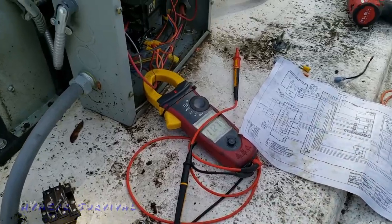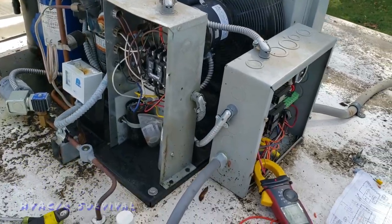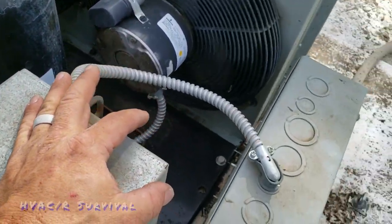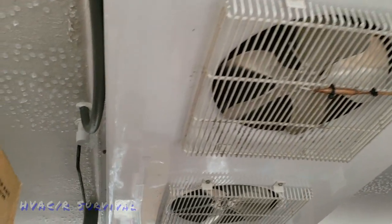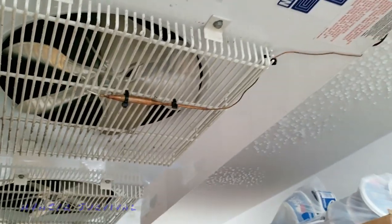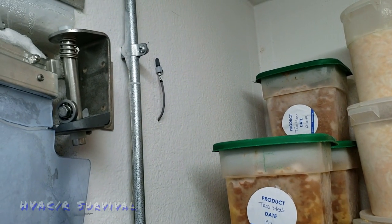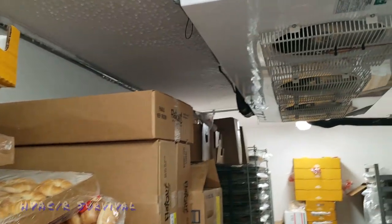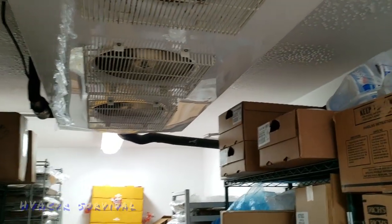It just terminated out of defrost - fans are kicking on, that's 13 degrees. Go down and see if the fans are on inside. Good - fans are kicking on with a delay on them. There's the new thermostat - they just came on with delay. The alarm sensor is way over in the corner. I don't know exactly why I'm having so many issues here, but that's where we're at right now.